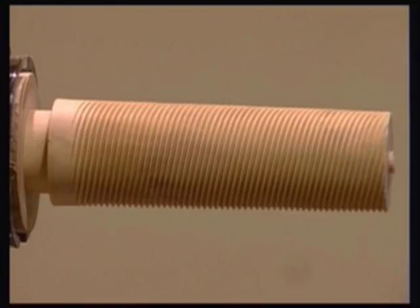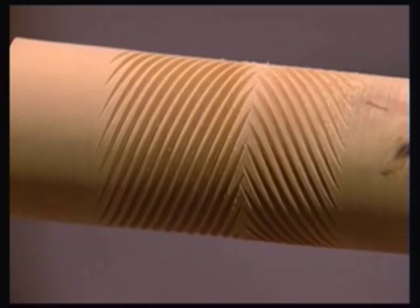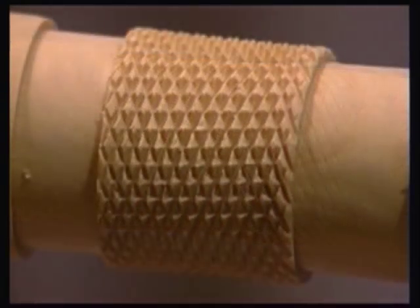This groove will not be to the full depth of the cutter, and it will be necessary to run the tool across the groove several times more until the full depth of the spiral is created. By angling the cutter wheel to the left and the right of the centre point, spirals can be created that slope in opposite directions. With a close-grained hardwood, they can even be superimposed one over the other.